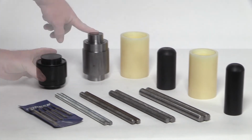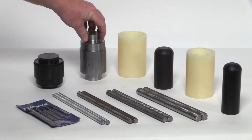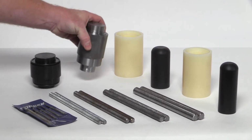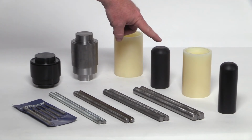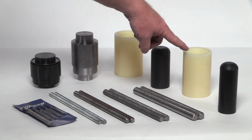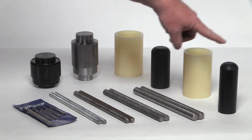A grease seal installation tool. This is a two-sided metal tool used in conjunction with a hammer. The small side is used for all pumps except the Z4200 and Z4500. Again, both of these models use the large side. The rotating seal installation tool and shaft guard for the Z4200 and Z4500 pumps, and the rotating seal installation tool and shaft guard for all other pump models.